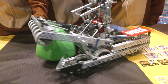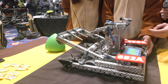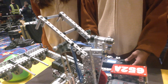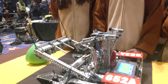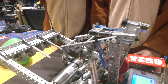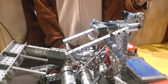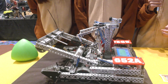Talking about your climb — your team is so efficient on the field. So our hang is powered by pneumatics and it's a B-tier hang. From watching other tournaments and robots, we saw a lot of motorized hangs, but those types of hangs are really slow to set up and also slow to lift up. That's why we decided to go with a pneumatic hang — we can hang and set up at the very last second. This helps with our game strategy because we can plow or keep scoring tri-balls all the way up until maybe the last three to five seconds of the match, and that helps us get a tri-ball advantage over our opponents.